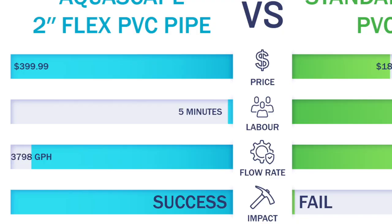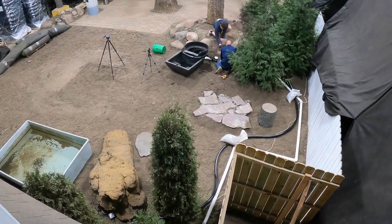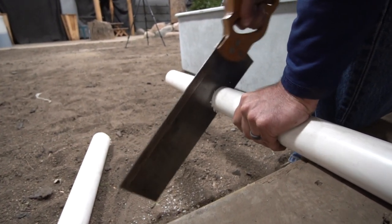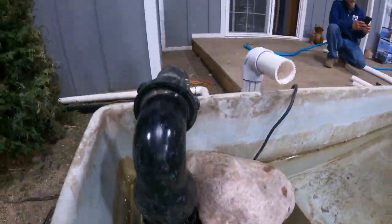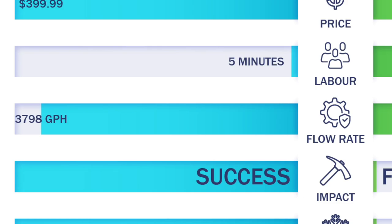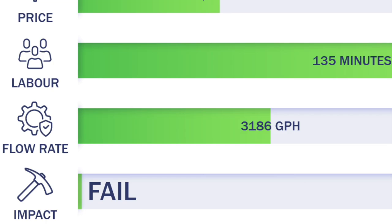Look at that next category — the labor, the efficiency of the installation time. Literally five minutes for me to make one connection, roll the pipe out, make the second connection. I don't have all those joints, all the cuttings, and all that stuff going in between. What's your time worth? If you're a consumer or a professional, where is that cost savings? Each and every one of those joints is a potential failure point. Having all those elbows and 90-degree bends slows the water velocity down. With the Flex PVC, we're flowing at almost 3,800 gallons per hour — 50 feet of pipe, two feet of elevation change from top of water level to top of water level. With all those elbows and bends, it drops down to about 3,200 gallons per hour. That's a 600 GPH difference, which is significant. If you're paying for that pumping velocity, we're paying the same cost for both pumps, but with one you're actually getting more water flow running through your filtration system, increasing the overall dissolved oxygen, and increasing the overall turnover rate — which gives you better water quality.